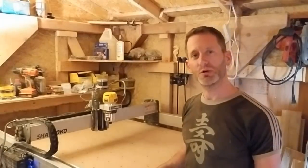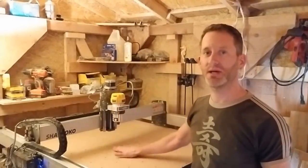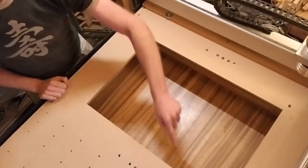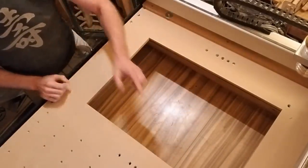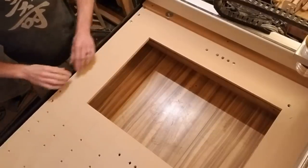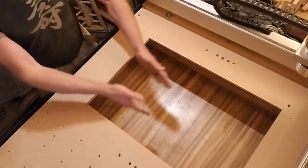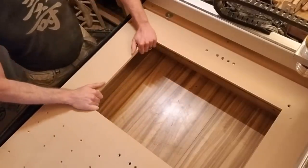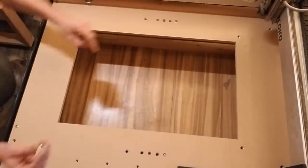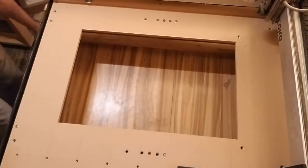This concept of a rotary construction required me to make some changes to the CNC frame, as well as the bed. To be able to place the stock deeper than a CNC bed surface, I cut a hole in a spoil board and moved the center metal bar of the Shapeoko to the right, using the right side screw hole of the frame for the left side screw hole of the metal bar, to open up as much space as possible without compromising its rigidity. I drilled holes into the CNC bed and then inserted T-nuts from the bottom up to fasten this frame.